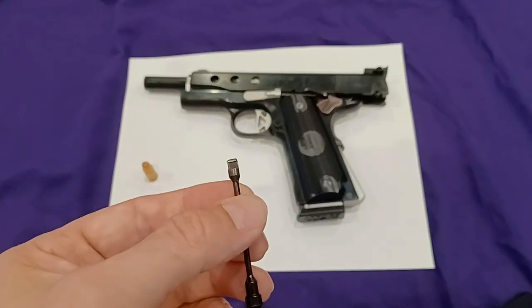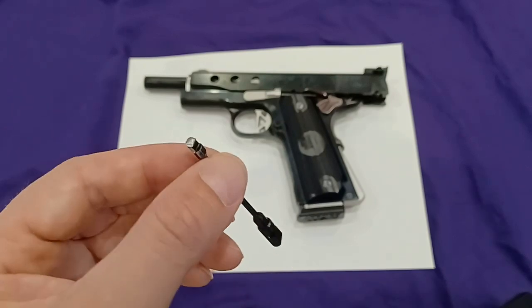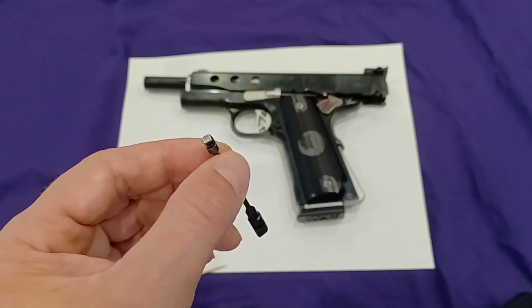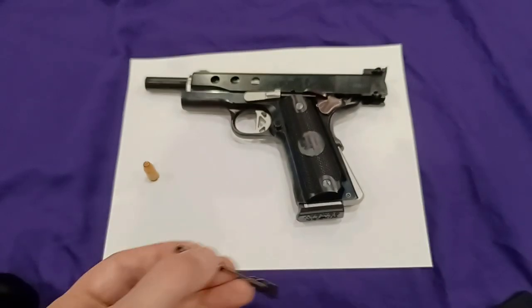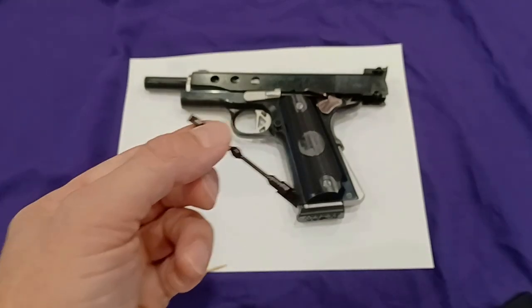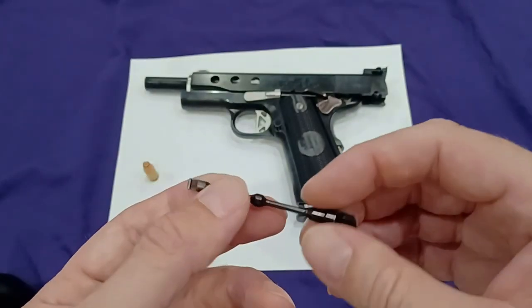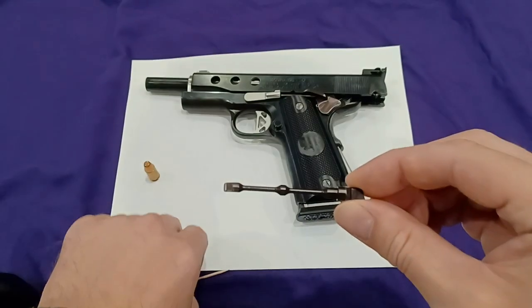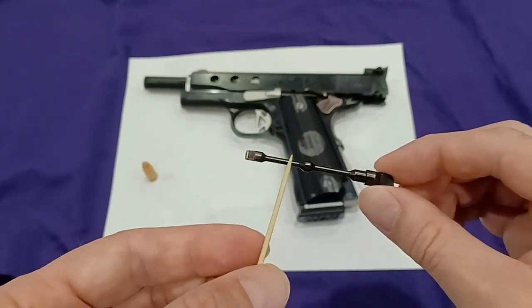This is a very technical, critical, and dynamic part. You have to understand that that rim and that web and the waistline in between floats and dances around this claw tip — sort of like spinning a basketball on your hand. The more experience you get, you'll be able to see it in your mind's eye. This extractor doesn't have a lot of rounds through it, but as you continue to shoot, depending on the profile of your ejector, this thing will start to take a set — you'll actually see this thing bend.